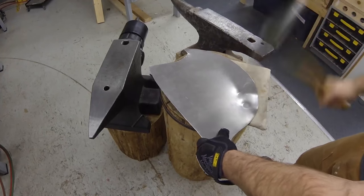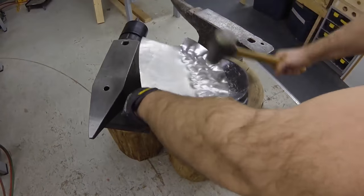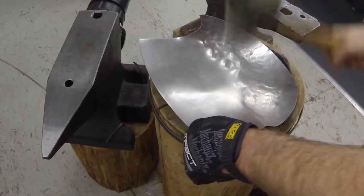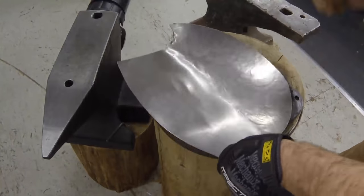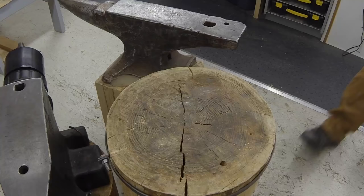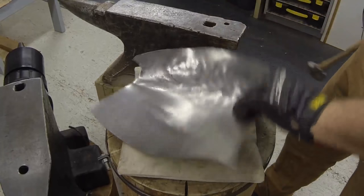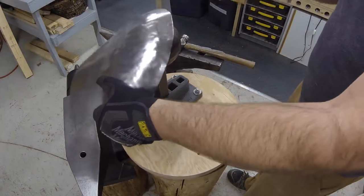Now straight onto the hammering. First I work it cold using a two and a half pound sledge. After the sandbag, I work it into the steel dishing stake. Now because this is 18 gauge you can dish it quite a bit before it starts to thin, and this particular armor wasn't intended for real combat — it's just a movie prop. So now I'm going to get out a modified ball peen hammer and just continue to dish this cold.